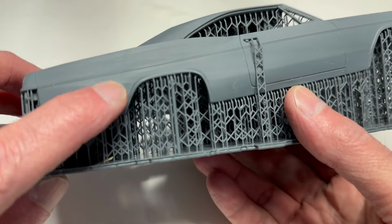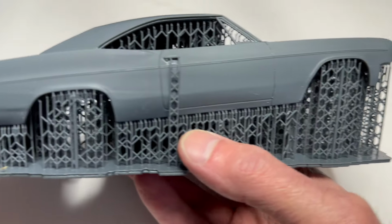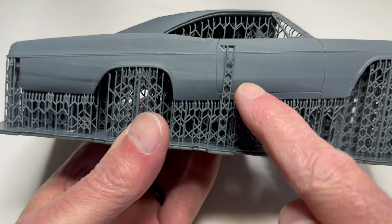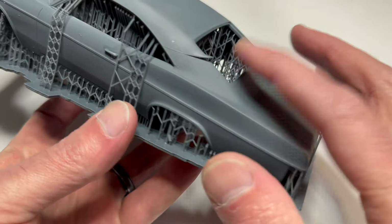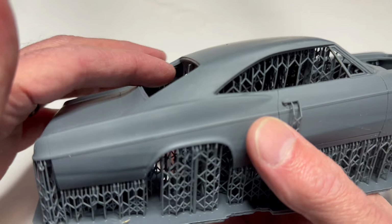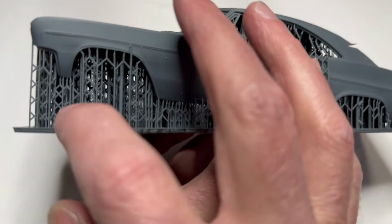Oh, looks like we had a Z shift here. Yeah, you can see the Z shift from all the way from here to right there. Okay. Why did this happen? If you look on the back side, there's no supports at all underneath here, whereas on this side there are supports. A little bit of a shift right here.